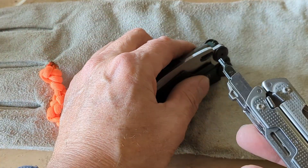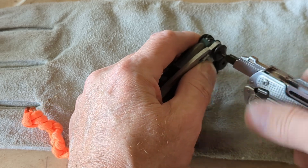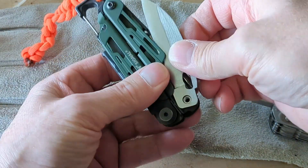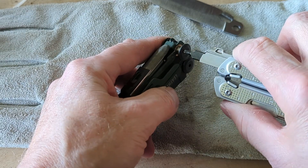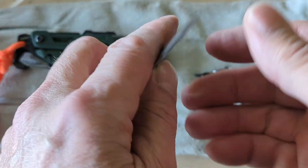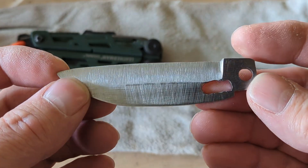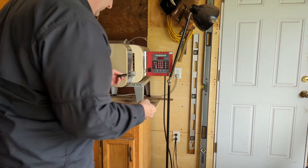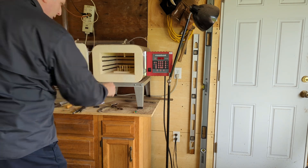It's time to do a heat treat. I have my Leatherman with a T10 bit in it, and we're going to take this blade off. Be careful not to lose the washers. The blade may look a little rough now, but it's going to get pretty heavily oxidized when it's in the kiln. So after heat treat, we'll clean it up and smooth everything out nice. I'm going to load the kiln, got the blade, and I'm going to lean it right up against one of those pins.